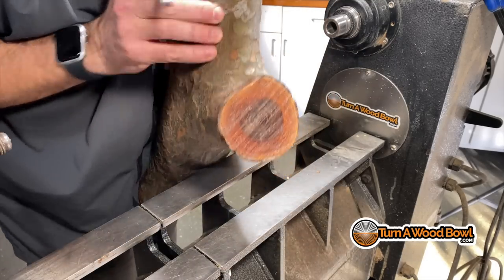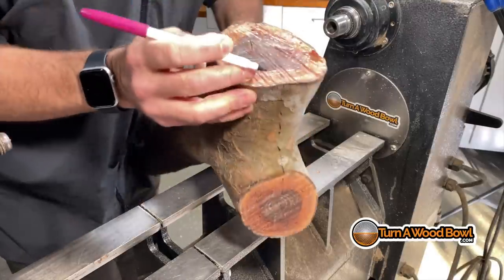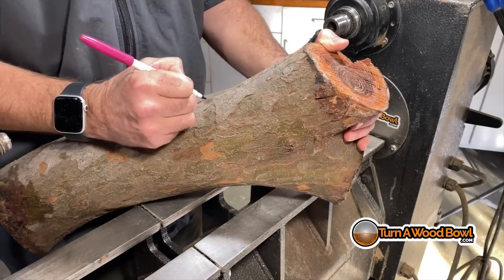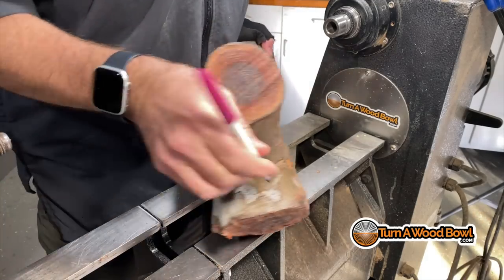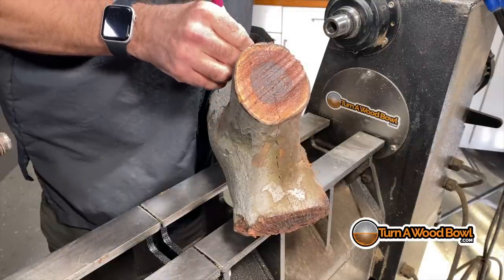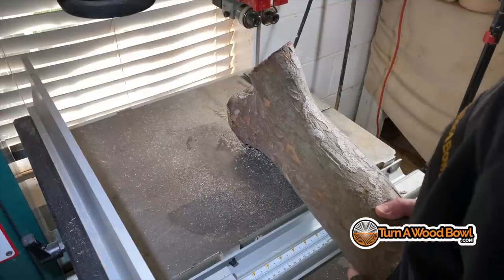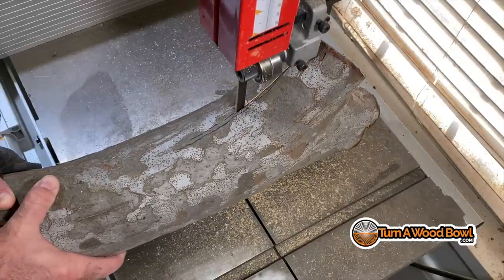Before I make a cut, I really want to visualize exactly where this cut is going to go — right through the center of the crotch. I use a marker, looking down on the piece to see where it's balanced. One branch is going to be a little bit off-center as far as the pith, but that's not going to be a big factor. I'll draw that line and flip it over to continue that across the other side, trying to get an even amount of material on both sides. I'm using a bandsaw, making sure the bottom portion fits tightly to the table for good support. Be super careful with the bandsaw — take your time and keep your hands away from the blade.